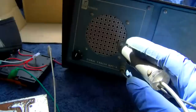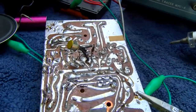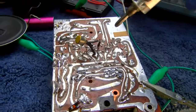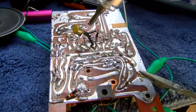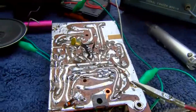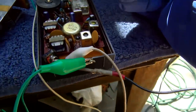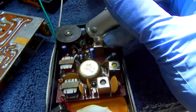And then we just got absolutely a whisper. I think I need to grab another different radio and compare it, because I'm really kind of lost here as to what my level should be. Is it weak coming out of the IF? Is it shorted audio transformers? What's going on here? This is just a single IF stage radio. And listen to the strength of this going into the volume control.